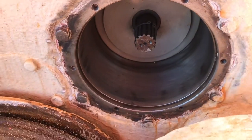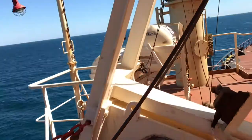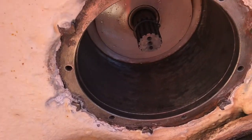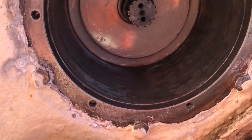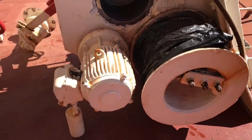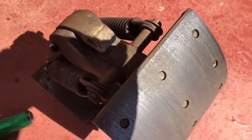This is the whole drum with the wire spooling inside. These are the wires connected to the lifeboat. When you release the brake, the lifeboat goes down via the davit and into the water. During servicing, if the wear on the brakes exceeds the manufacturer's requirement, the brake lining has to be removed and replaced with a new one.